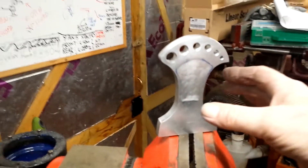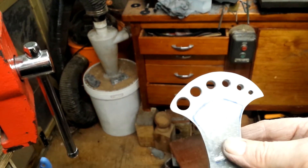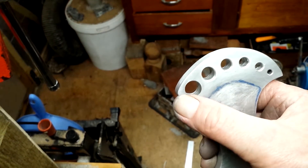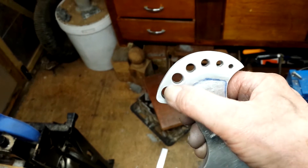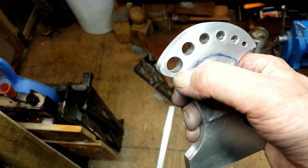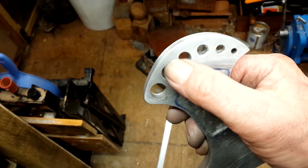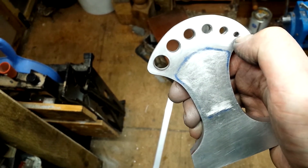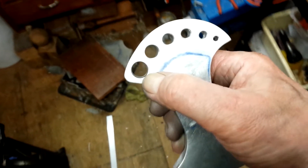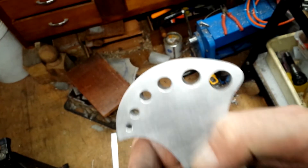Well, that turned out not too shabby. I think the holes are quite nicely laid out. I don't have any complaints with that — well within my tolerance. There were a couple of burrs thrown up because one or two of the drill bits I used were a bit blunt, but they came off okay by hand. The only thing is I couldn't find my hand-held countersink tool, so I've been able to put a little chamfer on the edges of each hole apart from the biggest one — I used a countersink drill bit for the five smaller ones, but it was too big for the largest hole. When I find the hand-held countersink — which will be lying right in front of me on a bench somewhere, I can be sure of it — I'll put a little chamfer on that one too. But no big deal; I'm quite pleased with this, coming on quite nicely.